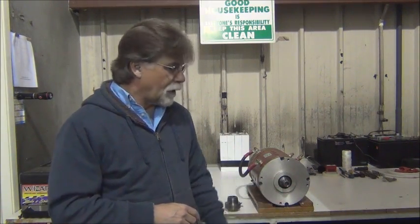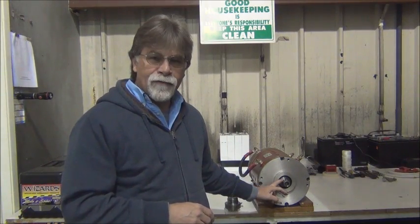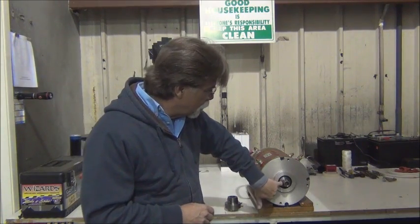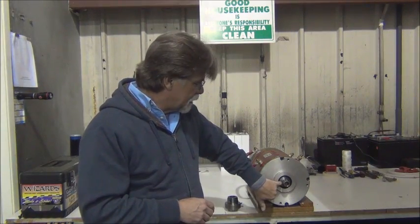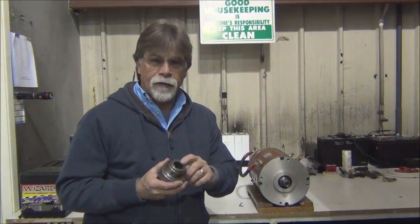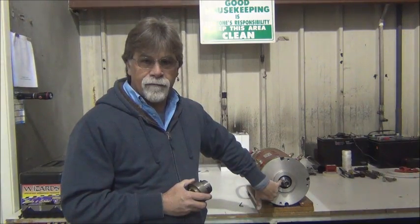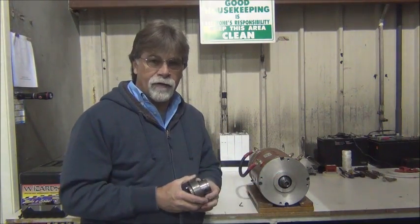I'd have to review the video to see what we didn't show before. I'll give you a close-up view of the shaft here. There's a little shoulder and then the inner race of a bearing. We're basically going to slide this coupler so that its inside edge seats right up against that shoulder on the shaft. We're going to change the camera angle but you have a close-up view there.